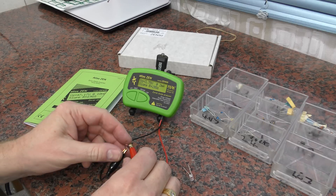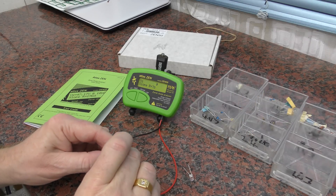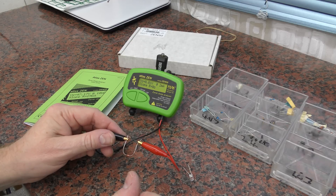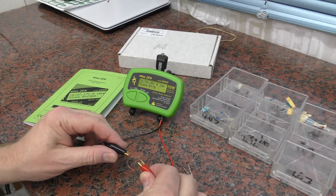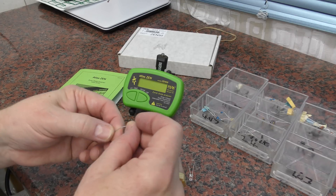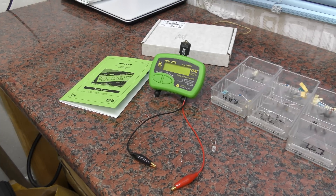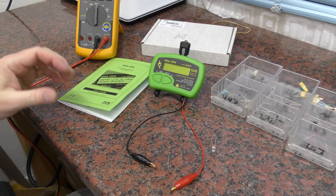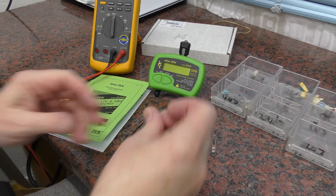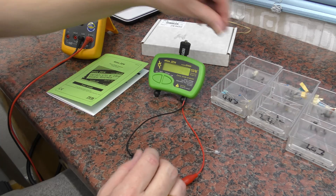I knew that wasn't going to stay on there for long. And again, 3.7 — that's interesting. We have a short circuit diode. Wow, I can see some solder on the legs of that diode, so we're just going to go and get our meter and measure that — because why on earth would we have put back a short circuit diode into the pot. And yeah, short circuit. Don't know how that happened, a bit embarrassing, but there you go. So let's pop those back — they're obviously reading a little low for whatever reason.